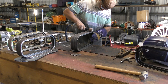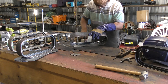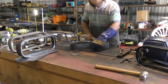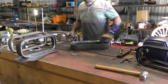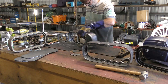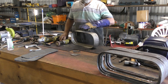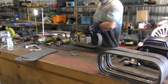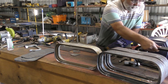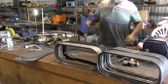Just to wrap up this final video — there are four box frames that I manufactured, two for each side through the cabin sides. The reason I made these box frames, going back to the very beginning of the process, was because the cabin side curvature is just too sharp to be able to put a flat port light through the side. So my solution was to make these box frames. They actually turned out pretty well in the end, and once I did weld them in, they look really nice, they fit well, and I think they'll do a really good job.